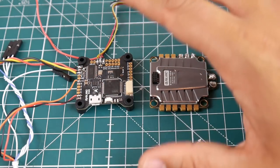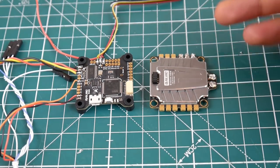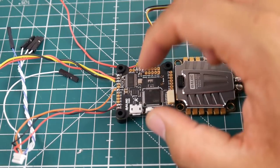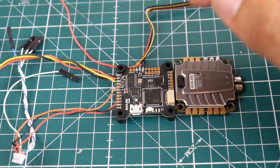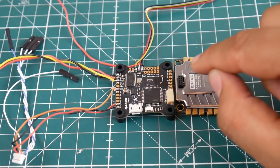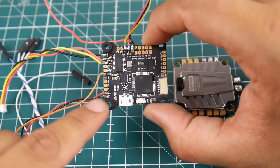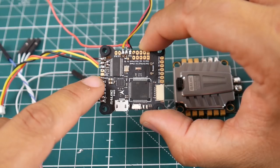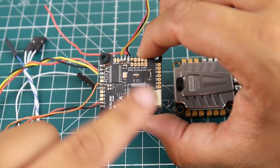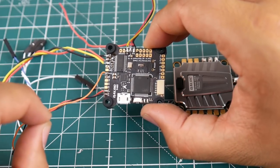I ran the yellow wires directly to each other and still had a black video feed. A black video feed means your camera's not working. So I tested the five volt regulator — I had removed the nine volt and set it to five volt on the camera — and there was no voltage on anything that was five volt. If you ever build this without connecting the pins, you have to provide two power supplies: battery voltage, and then the five volt input, which is what powers everything else on the five volt rail. The battery voltage powers the nine volt regulator on board.